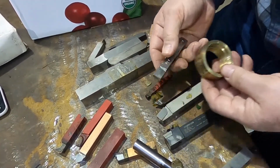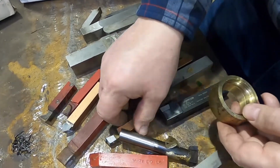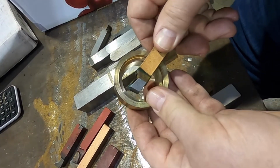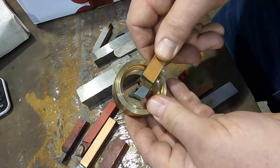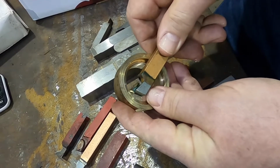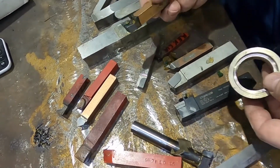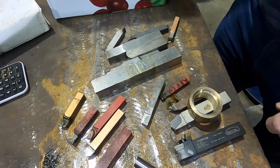But it exists. And again, even with this TSA tool, we're still cutting above center. We're just having a better geometry. So actually that measuring problem is still going to be a problem because you're still moving here and cutting at a point up above. You just have a nicer rake. It cuts smoother. It's one of those tools, not very often, but it's used there.